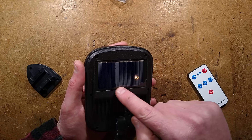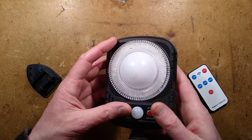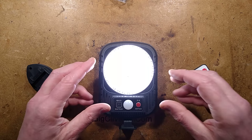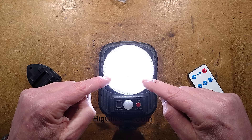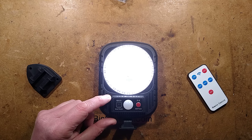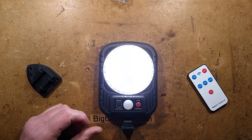It's quite small; I'd estimate it's going to be about 50 milliamps. So what I'm going to do now is set this up so it goes into its flame emulation mode. For that, I'm going to have to cover the passive infrared detector.